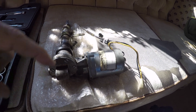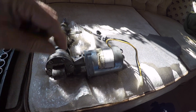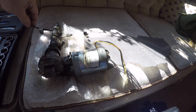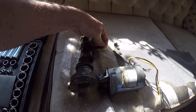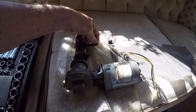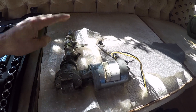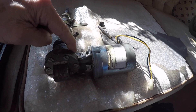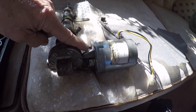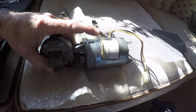The big thing I want to show here is how the motor is attached. On your worm gear you've got your flap indicator adjusters — this is what drives a cable which shows you on the console where your flaps are. The motor itself is held onto the assembly by a screw with a nut, which I've taken off, and one on the other side.